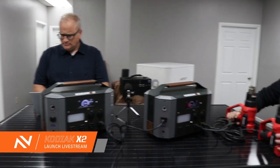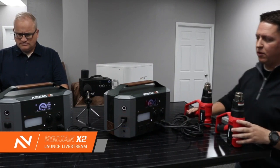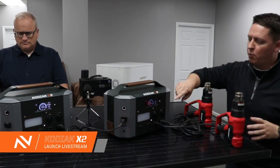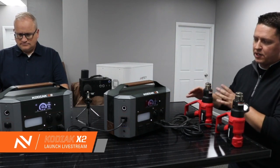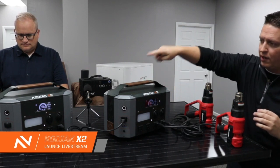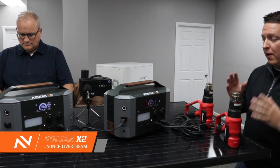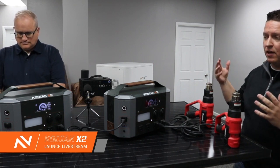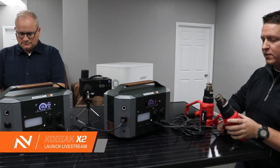I'll start the first one. So you can see on this one we're running about a 1500 watt load — that's one heat gun running continuously. It's sharing the load 50% between this unit and that unit; that one's running about 724 watts. This is about the maximum that most home circuits are designed to carry — a little bit more than 1500 watts, maybe up to 1800.